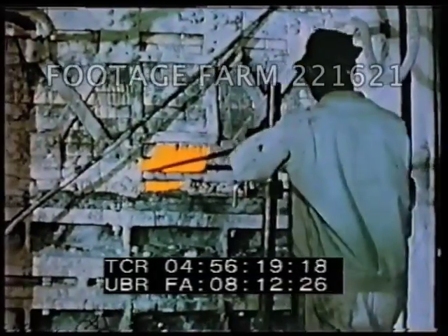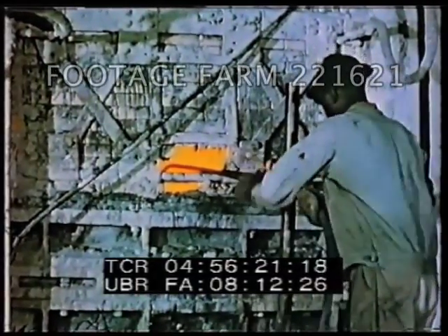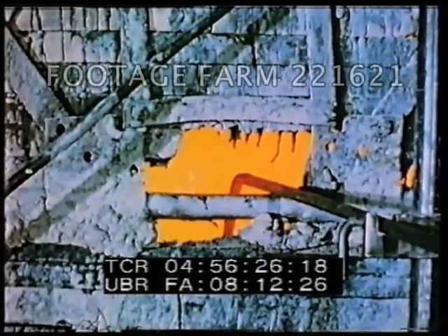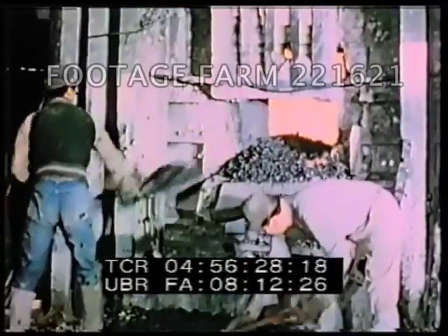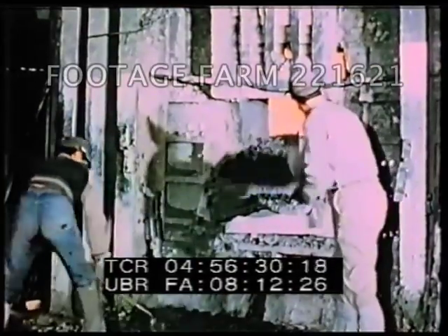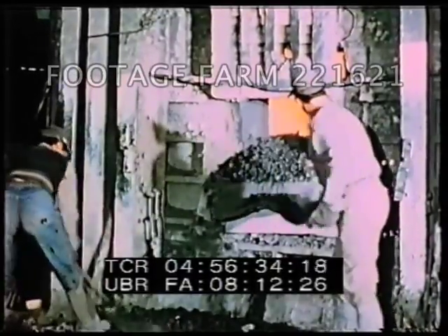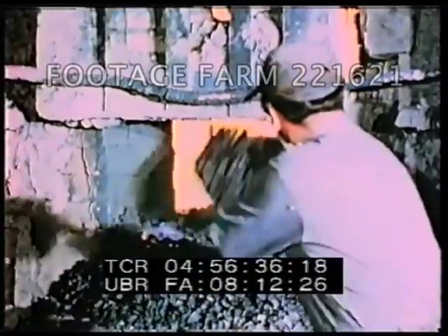In preparation for casting, the molten copper is subjected to air blasts forming some cuprous oxide. The molten bath is then covered with a layer of low sulfur coke. This protects the surface of the copper from further oxidation during poling and casting.